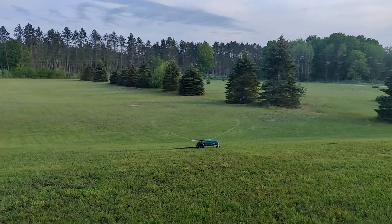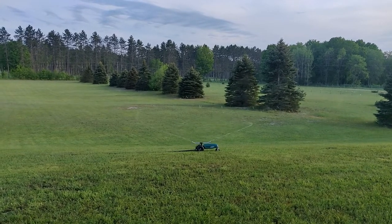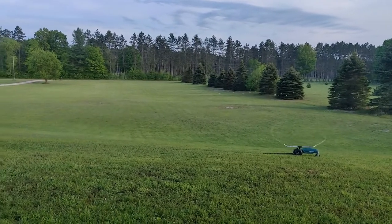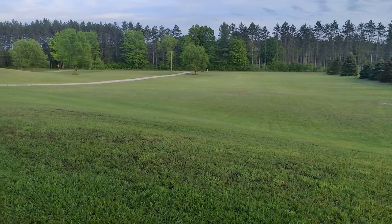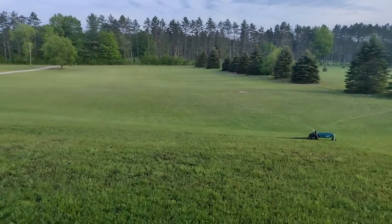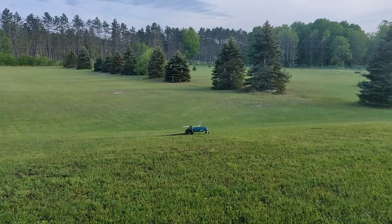My water pressure — I have a five-inch well and a three-quarter horsepower pump. The pressure tank is set at 60 psi for shutoff and 40 for turn-on, and it cycles the pump very quickly. When I'm running the sprinkler it only takes a few seconds to go from about 40 psi back up to 60 when it drops, so I'm keeping a pretty steady pressure. The static pressure on the line is right around 35 to 40 most of the time, and you'll see the sprinkler kind of pick up and slow down a little bit — that's a combination of its effort to pull the hose behind it as well as the pressure fluctuation between 40 and 60 psi.